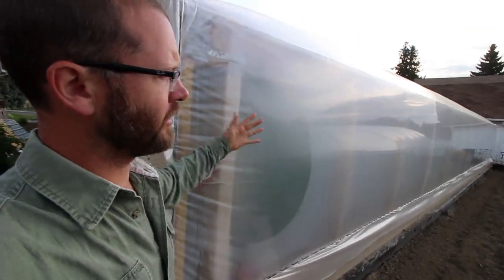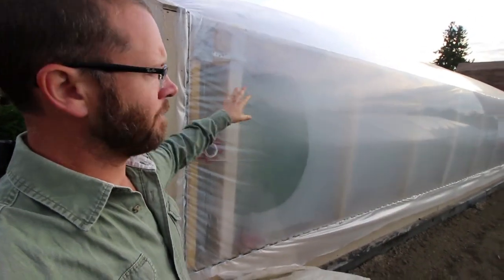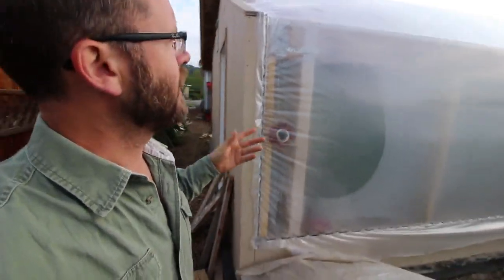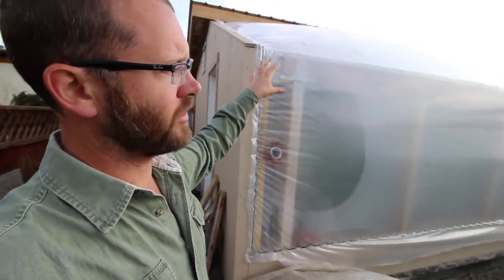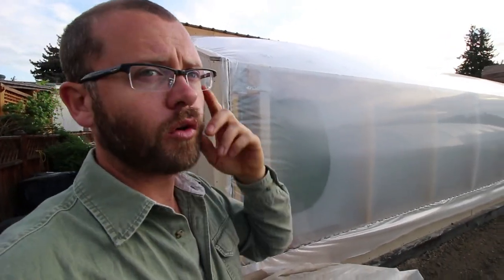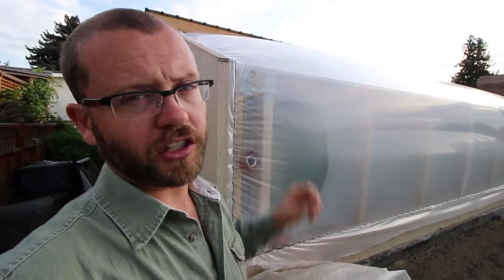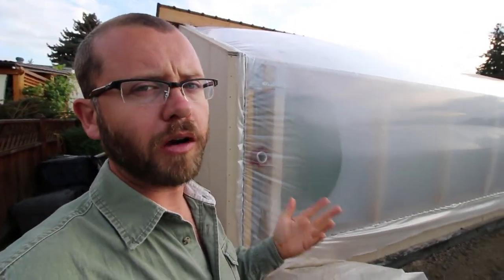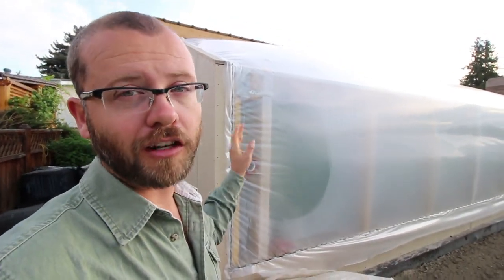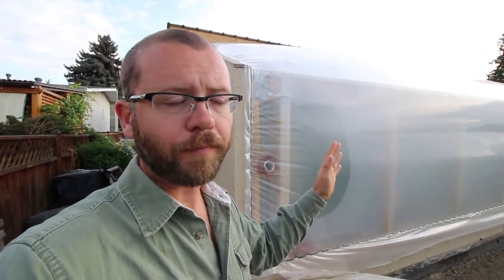You'll notice there are two layers of poly with a blower running — there's air coming out on the inside. Essentially there are two layers with a fan blowing air between them to create a cushion of air, and that acts as insulation. When I originally designed this, the plan was to put polycarbonate on the outside, which was very expensive. This greenhouse is 900 square feet total, and the polycarbonate to cover it was going to cost $8,000. We were already so over budget that I decided to scrap it and do a blower instead, which with the plastic and the fan costs $300 to get the same R value. So $8,000 versus $300.